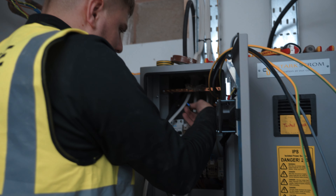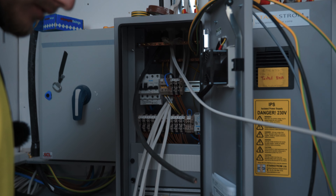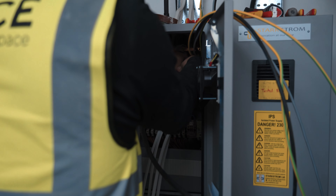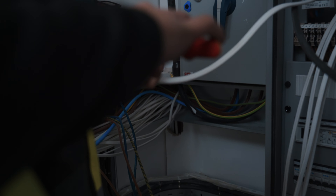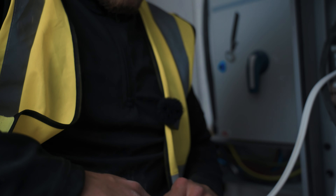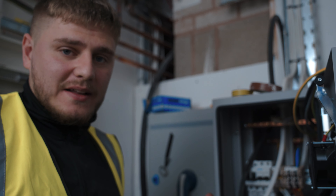Put these away. Like I said, it's super weird because I'm literally putting cables away with no earths in them — that's 12 cables away with no earths in them, but that's how it works. The earths want to be below 0.2 ohms, I believe that's the value. That's why you send 16mm earths to the earth bonding boards. And then every accessory has its own earth — literally every single socket, every single anything that's exposed or extraneous, every part of the circuit has got its own earth which goes back to the EBB.